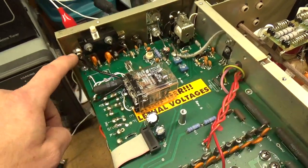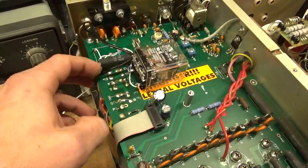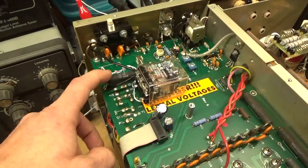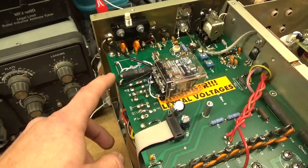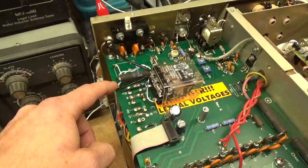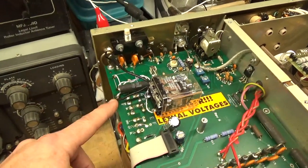Since it goes through the trace anyway from that switch, the other connection I went through the board, soldered both sides. The 10-ohm 10-watt resistor has leads on it — I go through the board and tagged off on one side with that wire going to the relay, to the board, and to the lead on the resistor.